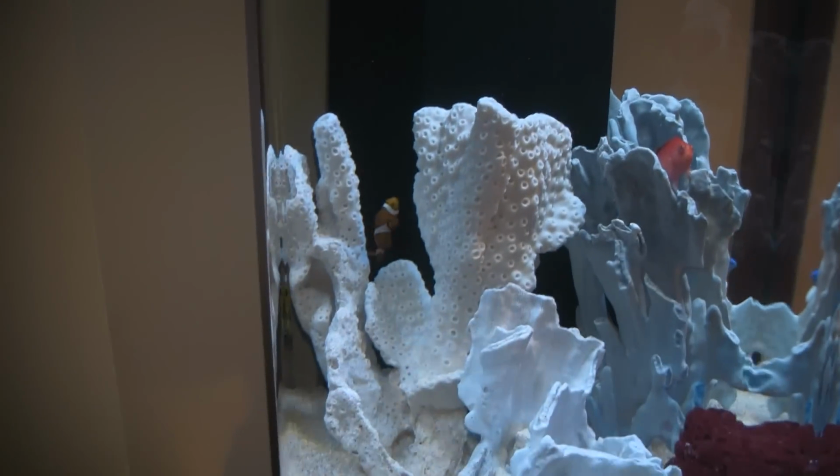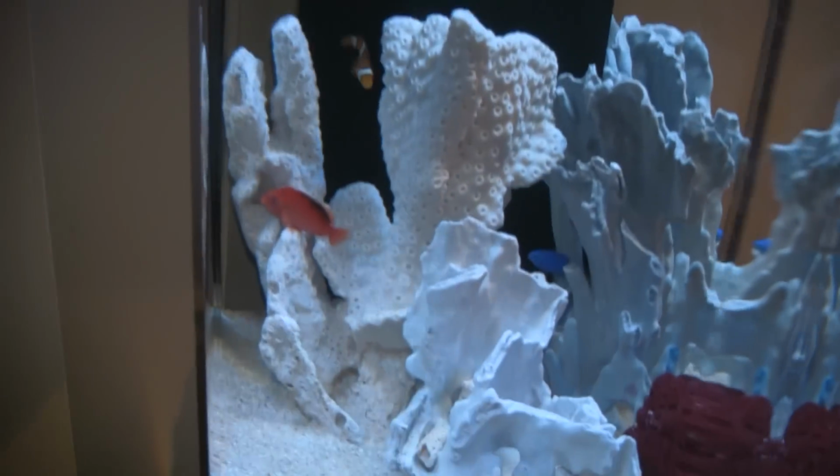This tank has an internal overflow. It's about a 90-gallon hexagon tank with a 3-sided internal overflow mounted in the back. And of course there's a drain out of the bottom of it, and the return line comes up and then pokes out through the face of the overflow. So again, there's an internal overflow inside the tank, and it's the bulkhead at the bottom of that overflow that is leaking.